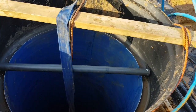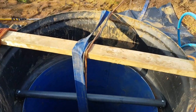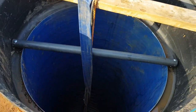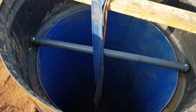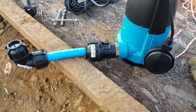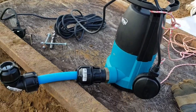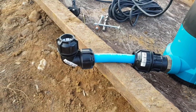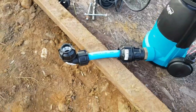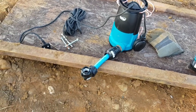The next step is putting in the pump. I've got the big one in at the minute — that one shifts thousands of liters an hour — but the one I'm putting in is just good enough to supply the taps. It's a little Katsu pump, cheap off the internet, plumbed into some 25mm MDPE pipe, so all the fittings become dead easy. For the rest of the main plumbing I want to do that once we have the well house in place, but this one is literally just going to pump straight in.